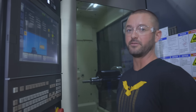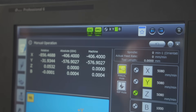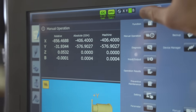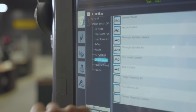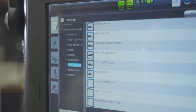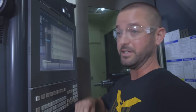Now I'm going to go over some of the coolant features. We are using the Synergy 735 from Blaser. Come up to the dropdown button, go to Functions, come down to Chip Disposal, and it gives you all your coolant options. We are going to start with the through-spindle coolant. We are currently set up for 300 PSI of through-spindle coolant, but we have our chip blaster being hooked up and it's going to provide 1,000 PSI.